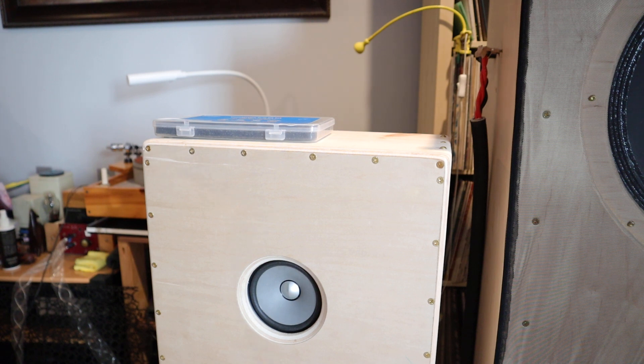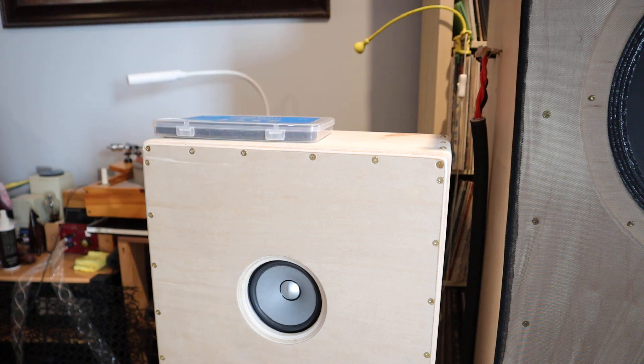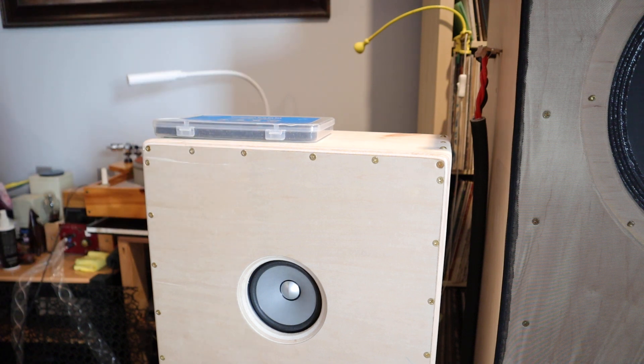Why? Because when the hole is not deep enough, when you reach the end the screw starts to tear apart the wood, which is not good. And if you drill a too deep hole, when the screw is in there will remain an air pocket in the back. You must avoid those air pockets because they are really harmful for imaging — they create resonances and high-frequency, very noticeable artifacts into the sound and give those unwanted box colorations.